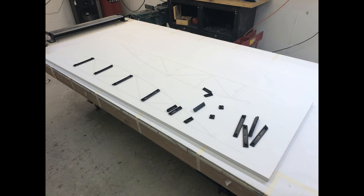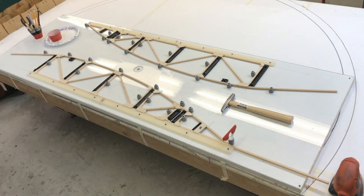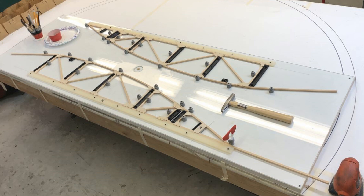I printed out on my plotter the paper backing, laid out the 3D parts, and lined them up to make sure what I'd drawn in 3D matched the real plan. I checked the dimensions between the drawings and my plan. Then I took a piece of plexiglass and laid it down, then laid all the parts on top of it. The plexiglass is so that I could put wax on it — any epoxy that dripped through or leaked through wouldn't stick.